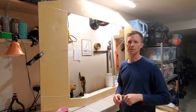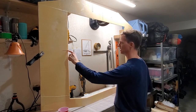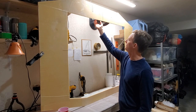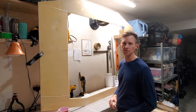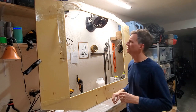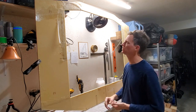With all the edge work on C2 done, I'm switching over to C4. This one is upside down — it's a big sucker. From this mark around, I'm going to reinforce the edge, and up here where the floor is going to be, I need to fill this channel with thickened epoxy. It's an hour and a half later and we're done. This time instead of peel ply, I tried using some strips of clear plastic, because even with peel ply I needed to sand to get the edges smooth anyway — so if I've got to sand anyway, why not just use plastic?